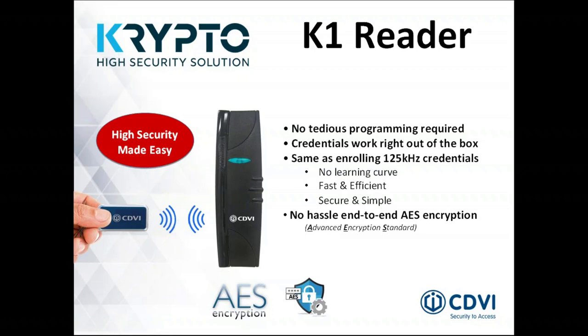For example, I'll give you a scenario. If I have an anti-cloning type reader and card installed that's not the CDVI, and one of the readers happens to be defective. So in this particular building, I've got this alternative solution from CDVI that has a solution for preventing card cloning. You need to, on each individual reader in the system, you have what is termed a reader configuration card. So through that software that you installed, you will be programming your encryption keys into that card.